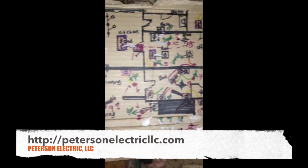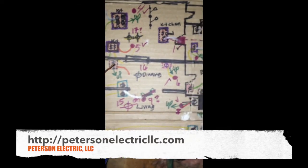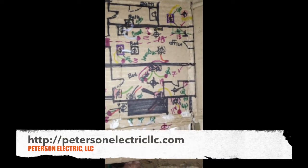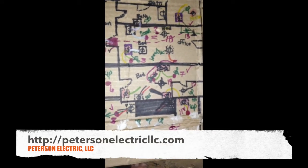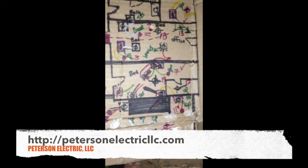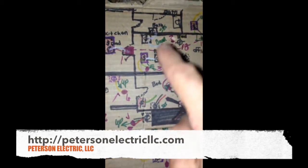This kind of shows me a schematic. The pink and purple was new cut-in boxes, the blue is wire mold on surface mount, and the black ones are old school metal boxes. The green wire was the white, the orange was the older white type, the green was the newer 14 gauge, and the yellow was number 12 new. Red and black was knob and tube, and the gray that looks silver-gray — that's my cloth.